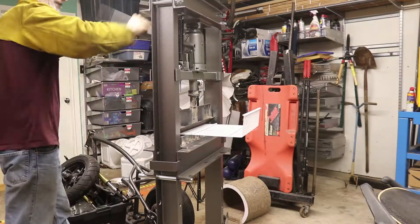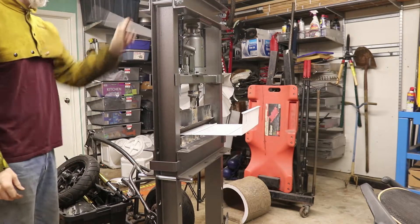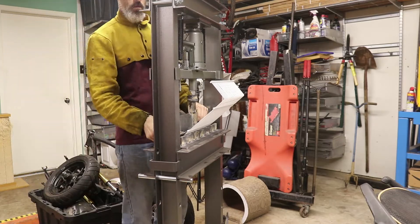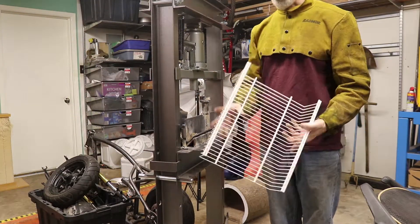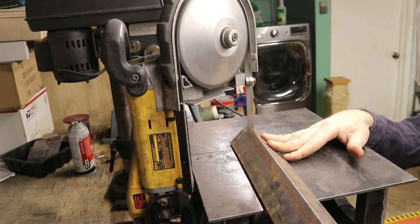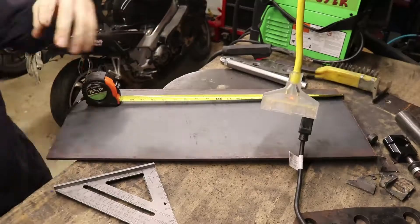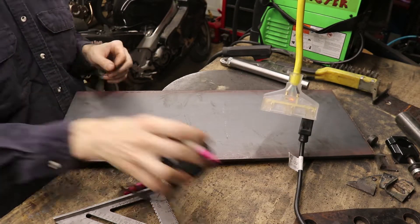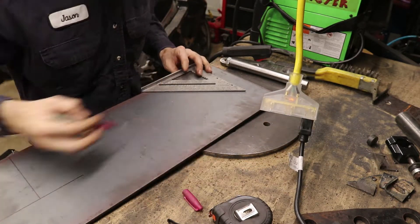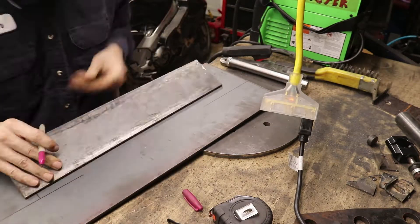In order to get to that dissatisfied point, I first had to figure out how to take the shelving material I had and bend it neatly so I had the shelving material I wanted. Already having a shop press and some scrap angle iron laying around, I thought this would be a great idea to incorporate all of these things together and make a really simple shop press brake. I first figured out how long I wanted the brake to be and then cut my angle iron appropriately. I then had a nice piece of quarter-inch plate that I used to make almost everything else for this shop press brake — though of course I had to cut it up into a million different time-consuming pieces.